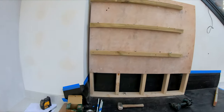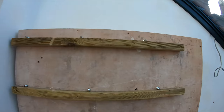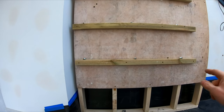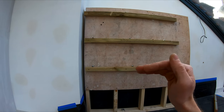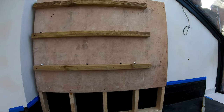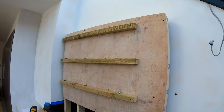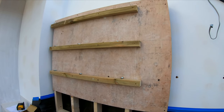We've fixed the bars into the wall using our little alignment system — they're all in there ready and perfectly level. Once the resin's gone off we'll take the template off and we know all the bars will be nice and level, so when we fix the shelves to it they'll be level too. It's a bit long-winded but by doing it this way it ensures our levels are exactly where we want them — that little extra step makes the difference.